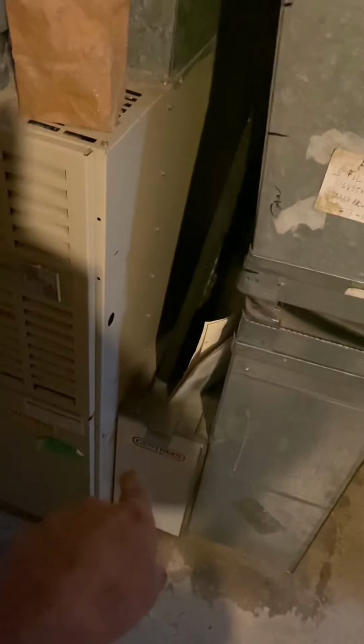So your cut line will be just, I wrote it on the bottom of the duct. Sorry, my flashlight went out, but side to side, and you'll take this out. And there's a duct coming off the side, you just modify that a little bit. But that just goes to the bathroom, so doesn't want too much. Anyway, so you put in a 20 by 25 filter box, duct just as it shows, cut line up here, side to side.